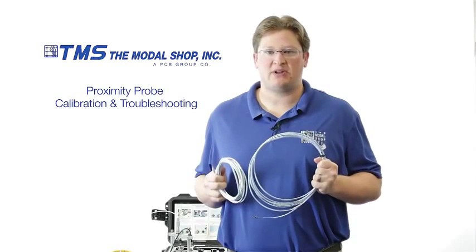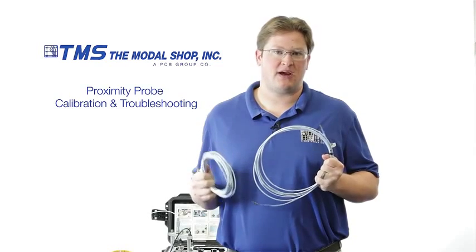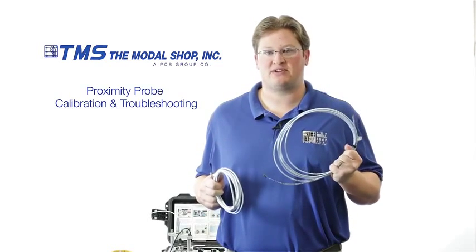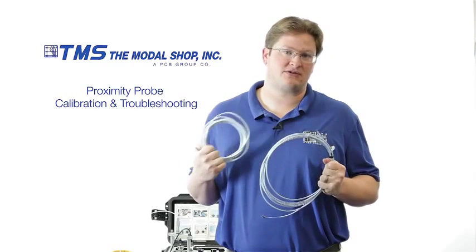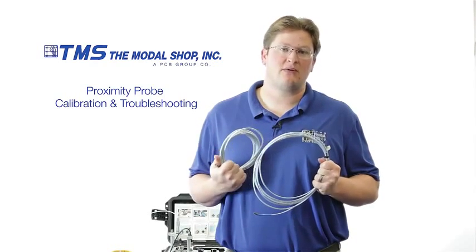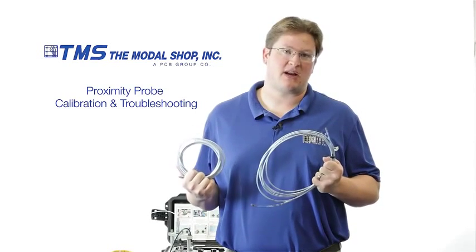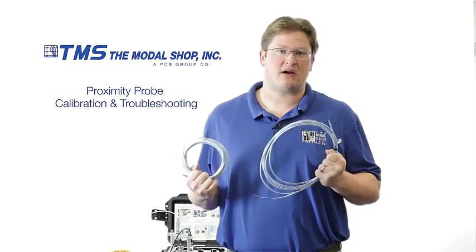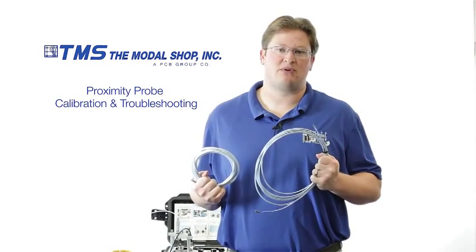You can see how a cabling error can easily occur. This is my 4 meter extension cable and this is my 4.5 meter extension cable — they're the same color. I've coiled my 4 meter extension cable a little tighter just so I can tell the difference quickly without having to find the model number. They have the same color and the same connections, and this type of mistake upon reinstallation of proximity probes can affect the dynamic output of the sensor.